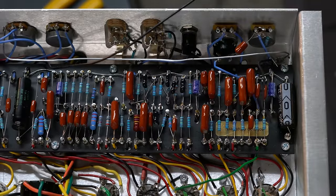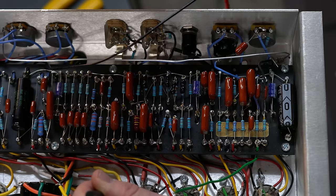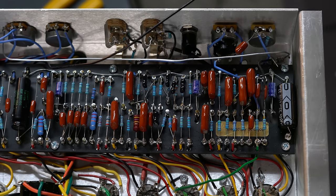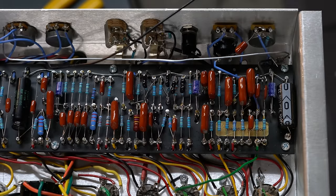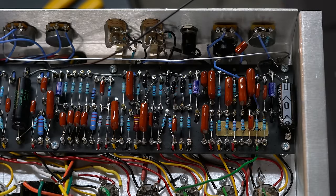Now we have a good ground there. As I've mentioned before, it never hurts to do a quick continuity test — just connect to any grounding point and test. Getting ground there, getting ground here. Once I solder these I'll want to test off the actual physical grounding bus as well. When everything looks ready, I go through and measure resistors to make sure they're right, and check capacitors — once they're in circuit you can't measure them but you can read the numbers. Resistors you can read the stripes, but anyone can get confused on colorings, so it's better to measure and be sure. You also do continuity tests to make sure you're not accidentally bridging pins.